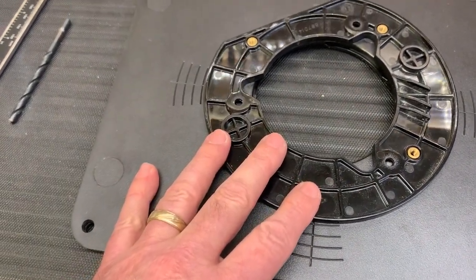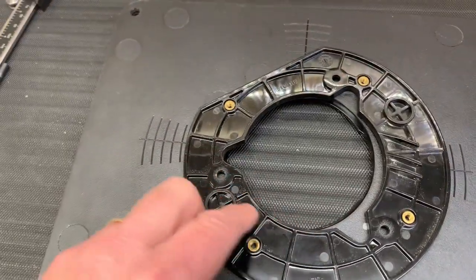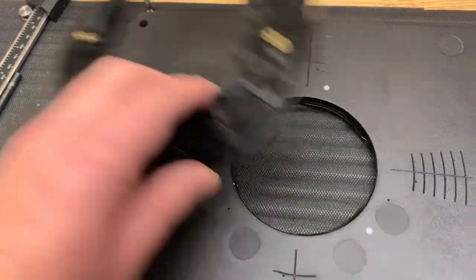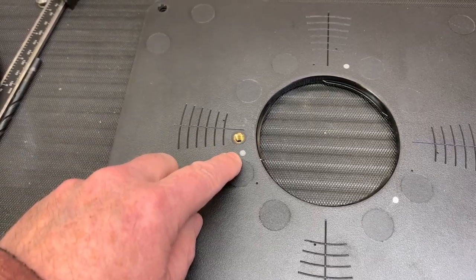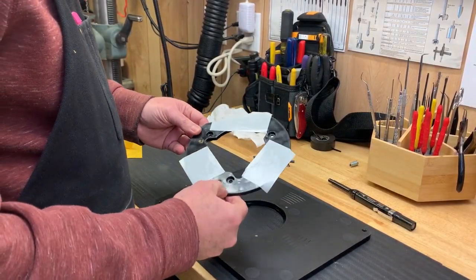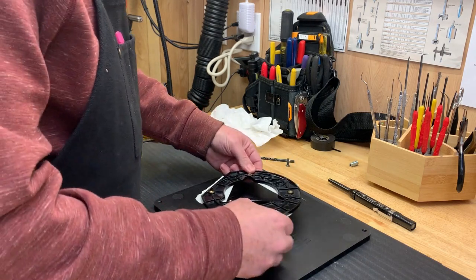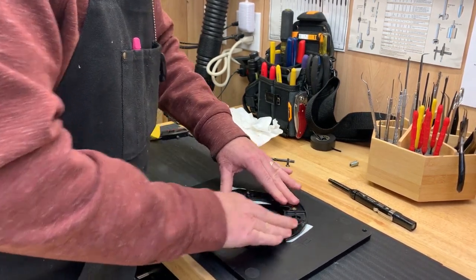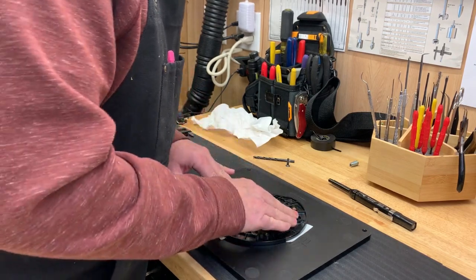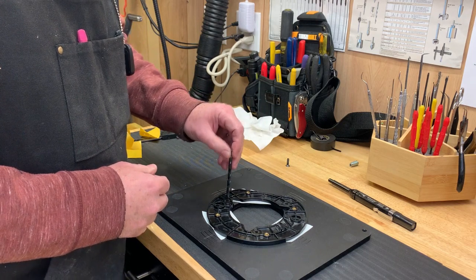It's a little bit over four inches like that. From there I marked through the mounting holes where I should drill. Based on that, I checked the hole positions — I'm kind of close to a guide pin threaded insert, which is about as close as I want to get considering I'll be countersinking the screw head. I applied double-sided tape to the router base, flipped it over, lined up the marks on the insert plate, and stuck it down as a drilling guide. With the plate securely stuck on, I'm now going to drill these holes using a 9/64th drill bit — the same size as the holes in the plate — drilling from the backside.